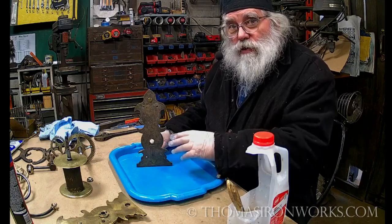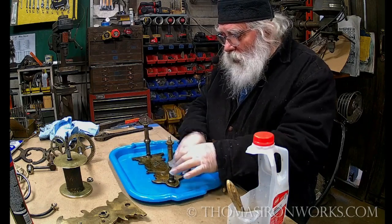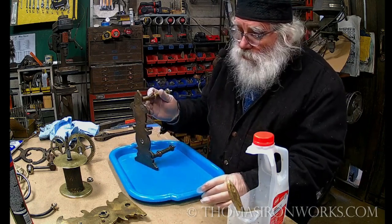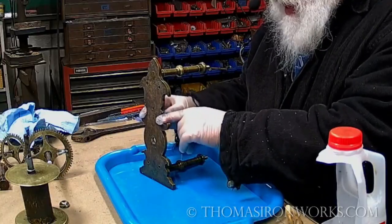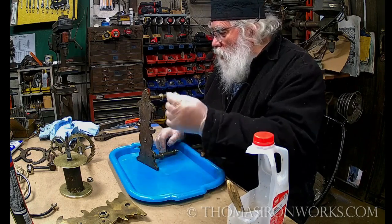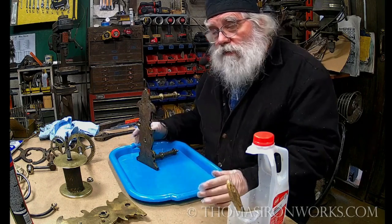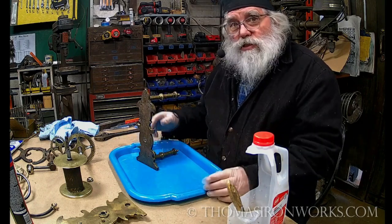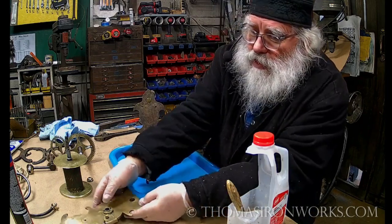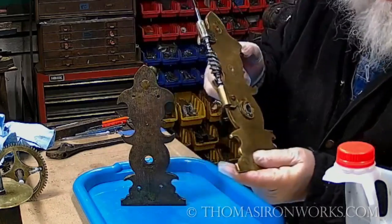I'll usually put it on and let it sit for an hour. In this case I even put the piece face down in a pan with little plastic spacers, so it sat in a bath of lye for about one hour. When I came back, I was thrilled. I took just a brush across it - that hard-packed polishing compound that was in even the cracks came right off. You can use a Scotch-Brite pad - you don't even need steel wool. Steel wool scratches; Scotch-Brite doesn't scratch anything. With lye soaked for a while, every bit of that black nasty came off.